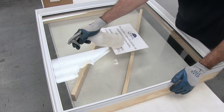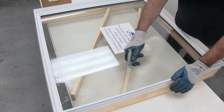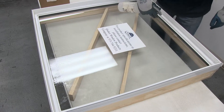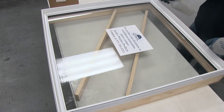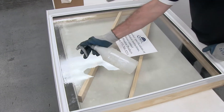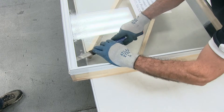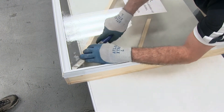To deglaze the glass, you'll want to grab a mixture of alcohol and water — half water, half alcohol — and lubricate around the frame-to-glass area. This will help cut the glass free. You'll then grab your deglazing knife and slide your blade between the frame and the glass and cut all the way around the frame itself.